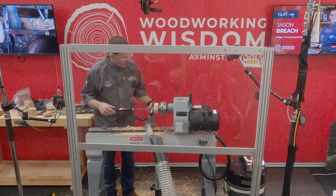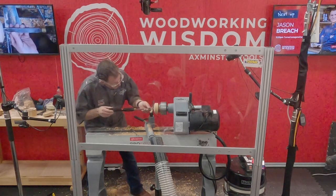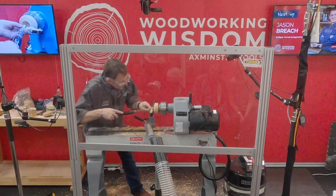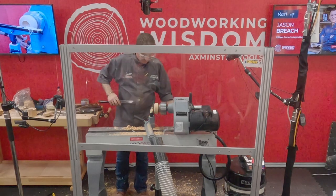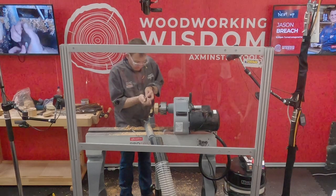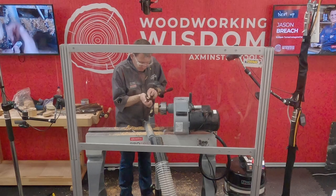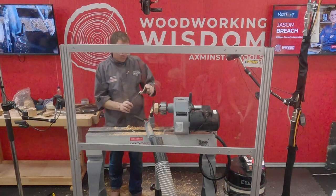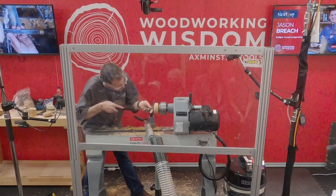If any of you play with your scraper — keep it level and I can work in either direction. Because I know someone's going to ask how to sharpen: I'm going to use a diamond file. I'll turn it over and just bridge across that hollow to take any burr off, then push up the bevel on the front and work around that shape. The only time this goes back to a bench grinder is when the bevel becomes flat — then I put another hollow back in and back to the diamond stone.